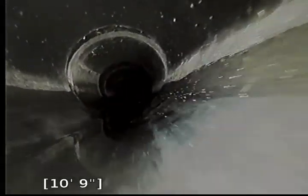We have a full bathroom on this side of the house, and then we have a half bath and a one and three quarter bath right past this. There are three bathrooms upstairs — the master more above, vertically, where we're at right now. So those will all dump into the system. We're going to have a bunch of T-junctions we'll go by, where everything dumps in: the utility sink, the laundry, and the continuation of all the bathrooms. This is all new plastic 4-inch ABS pipe — either built this way or upgraded, not cast iron. This is good; it's what you want to see.